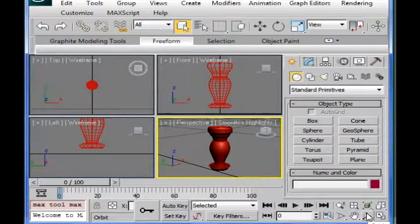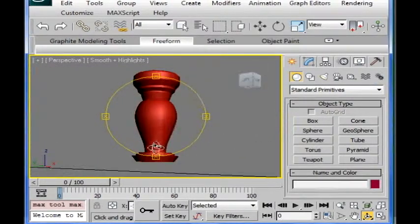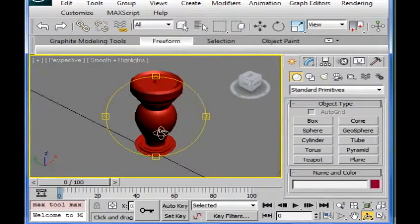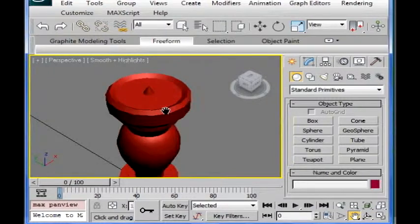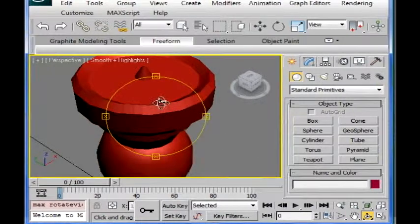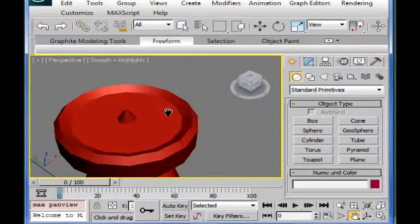And this is what it looks like in 3D. There are still issues that I'm trying to negotiate with this object. I've got a very thin kind of rim at the top. The whole point of that rim is that it is going to have other pieces lay on it. Let's say a corner of one object is going to lay on there, and that corner has a shape cut into it, a shape like this rim. But it's possible that I have to redesign this, because the MakerBot really can't make a rim quite like this.